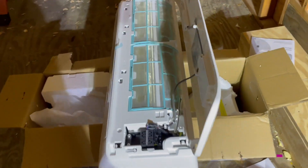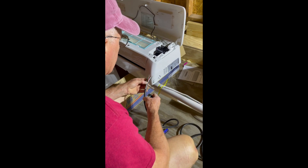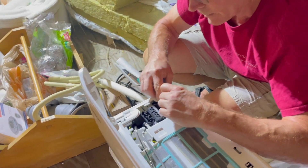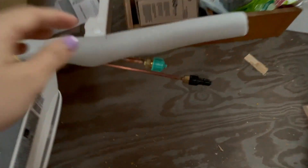The kit comes with the wire that connects the two units — a bit of a choose-your-own-adventure where you pick what colors go with what numbers. We did reverse alphabetical: white, red, black — important to remember because the wiring to the exterior unit needed to match. The copper hoses connected to the unit were pointing the opposite direction of where we wanted them, but that was okay. You can move the pipes, but you have to be very careful — any kinks in the copper pipes and the unit won't work. Doug very carefully got them pointing the other direction.